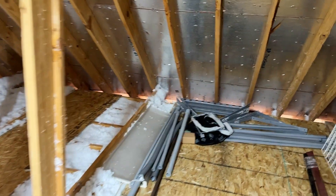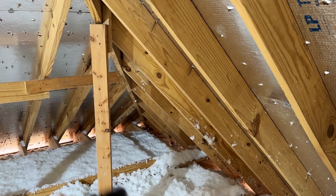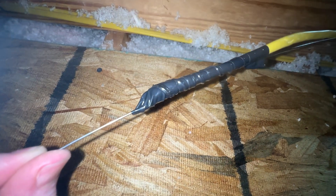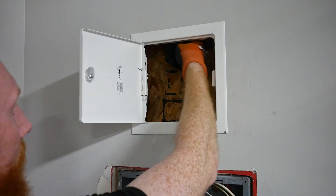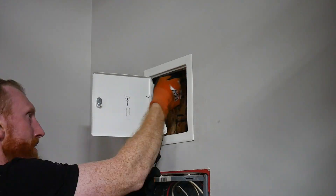Up in the attic, this back corner is going to be where the panel is and the access panel above my breaker panel. The panel is all the way in this corner over here — you can kind of see those wires going down. I'm going to use some fishing tape to get into that hole. It was a little tight with the thick taped-up section at the front of my fishing line, but I was able to get it down into the wall cavity without major issue.